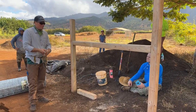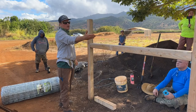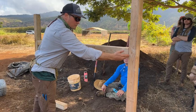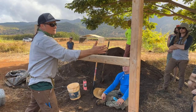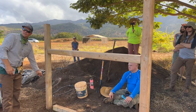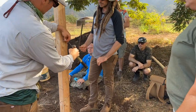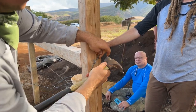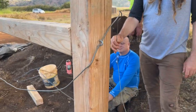We're going to put our H brace in. Our fence is being stretched this way, in this direction, so this is going to be our corner. That means we're going to want our 45 with our bracing wire from this point to this point. So that when the fence wants to pull this way, it's being pulled back to the low spot — it's stronger down here. You can just put a staple in up here, and don't put it all the way in — just like a guide right now, just kind of holding your wire.